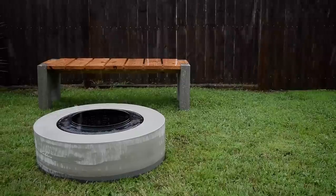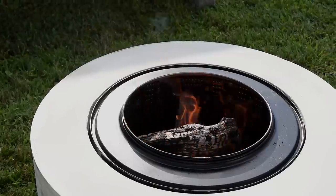Overall I love the way the project came out, however I'm going to convert it to a gas fire pit at some point — I'm not a big fan of the wood-burning setup. I'm a little bummed I couldn't get night footage since the rain was a constant problem; I only have about three hours of burn time, so I can't give a true evaluation of how it would hold up in the heat. The biggest recommendation I can give is: do not put fire directly inside the concrete form, because that will crack the concrete and in some cases could cause it to explode. This mix is only rated at 300 degrees Fahrenheit. Once I do the gas conversion the only addition may be a bowl above the fire pit so the flames are a bit higher.